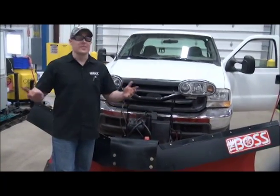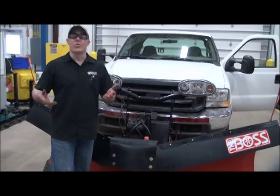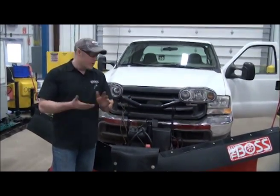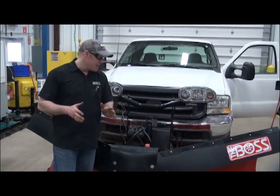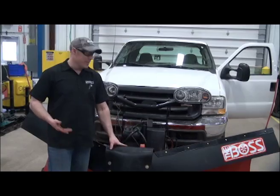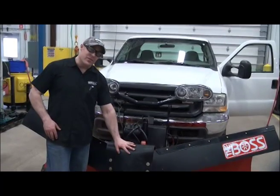Now, like I said, a lot of this stuff is in the instruction manual. Look it over, highlight whatever pertains to your size and model of plow, and go with that, all right? But remember a couple of the tips that we talked about: tapping the center section, trimming off the front edge, things like that. Making sure that that curl is in that center flapping. That stuff really helps.